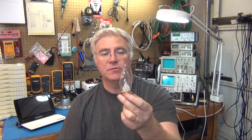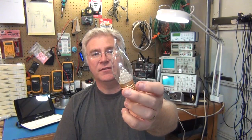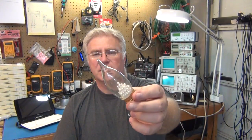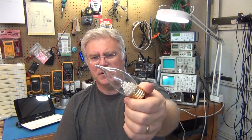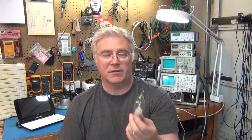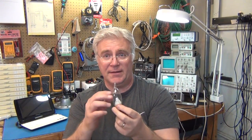The incandescent light bulbs need a vacuum for the tungsten filament to exist in, so it doesn't get around oxygen. There is another type of gas in there, I believe, maybe an argon or something, that would normally be used in a filament style light bulb. The tungsten actually boils off when it first starts up, and then when it comes to temperature, that little whiff of gas inside allows it to redeposit back on the tungsten filament, so your filament lasts longer. Standard light bulb technology, but no point in having the bulb here at all.